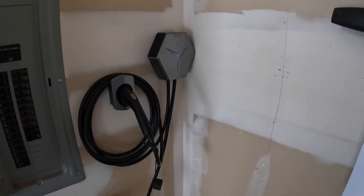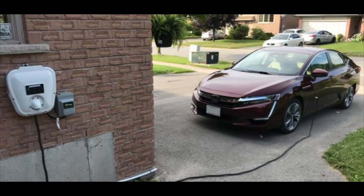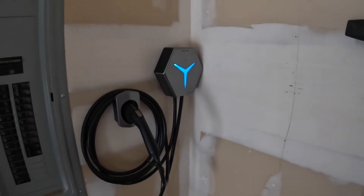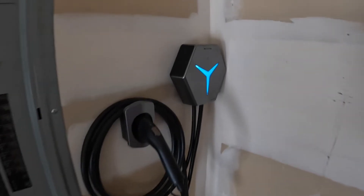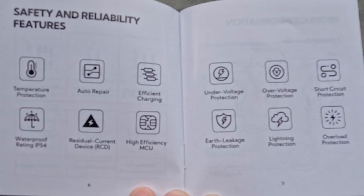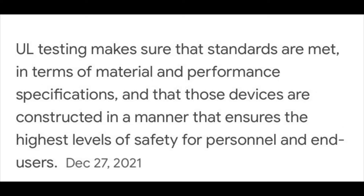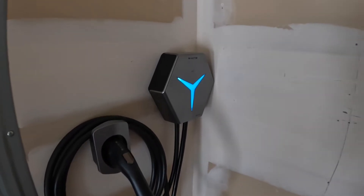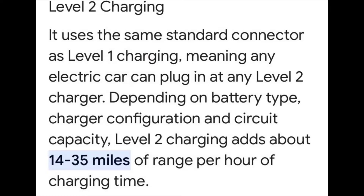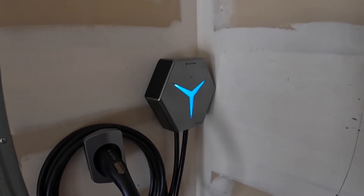This could actually be very useful if you install the e-Kite outside, which you're allowed to do because it's IP66 water resistant. That way, no random EV owners are going to successfully take your juice without a card. The big benefits of the e-Kite that stand out to me are its IP66 water-resistant rating — so even though I'm not going to be plugging it in outside in the rain, it's nice to know it's a closed system and I could if I needed to. It also has advanced software tech to help prevent overheating and other issues. It's UL certified, so it's been third-party tested, which means you have peace of mind — I would not consider any electronic, especially something like this, if it's not UL listed. This one charges at 32 amps, which isn't as high as the NEMA's max capacity at 40 amps, but it's still faster than some other Level 2 chargers, and charging at 32 amps creates less heat, so there's less wasted energy, meaning it won't be as expensive per kilowatt-hour.